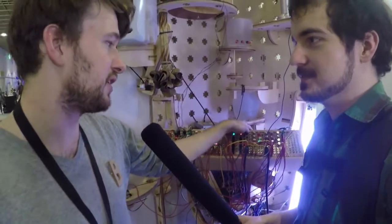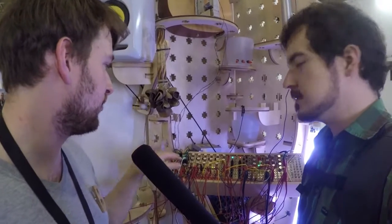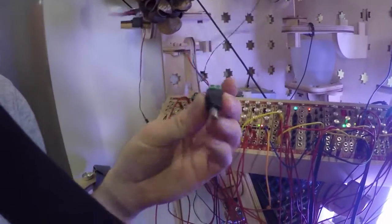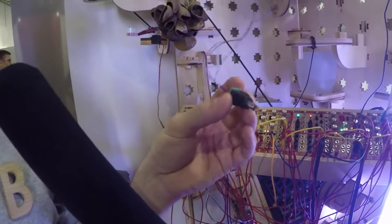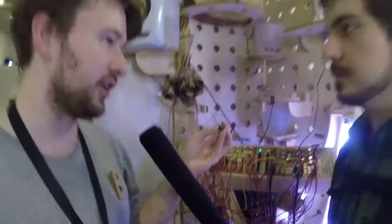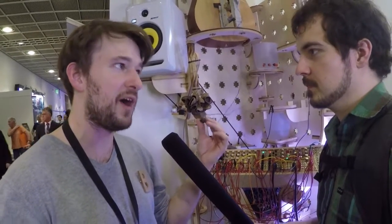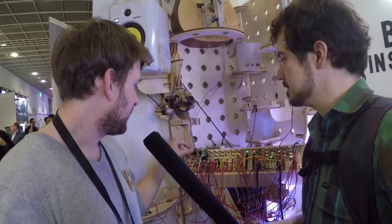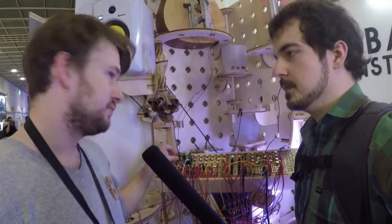You really don't want to drive motors with your synth power supply — it would draw a lot of current and could be really dangerous. All those connectors use a screw-type design, so if you have a motor with bare wires coming out — which most motors do — you don't need to make a special cable, just use a screwdriver and screw it in.